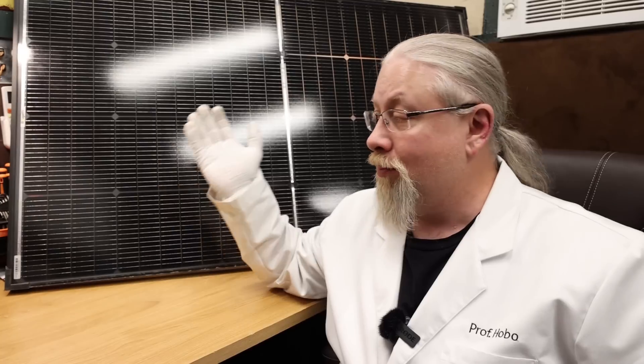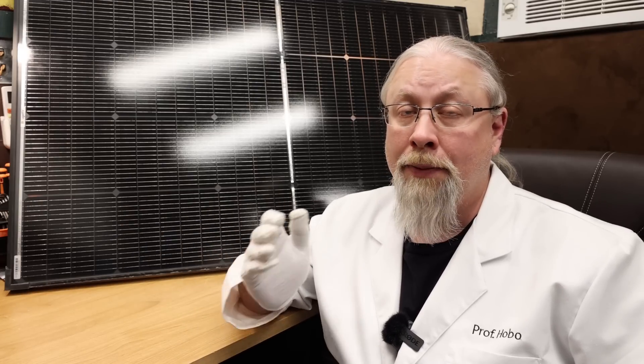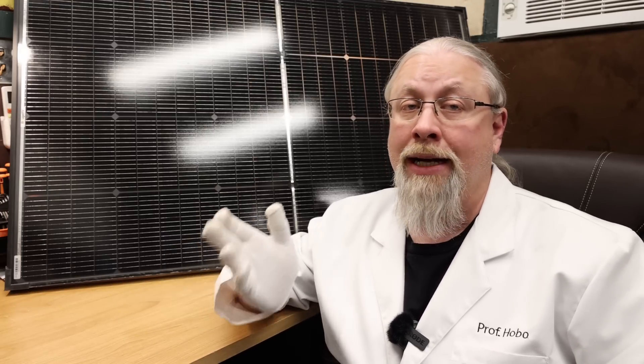There you have it — some really good results. On a typical clear sunny day, measured watts per square meter locally is usually around 1,200 to 1,300. During our testing, however, we measured between 1,020 and 1,080 due to high winds kicking up dust into the atmosphere — typical up here in the mountains in the springtime. At sea level under perfect sky conditions, you can expect 1,000 watts per square meter. Temperatures during testing were between 68 and 72 degrees Fahrenheit, which almost exactly matches lab testing conditions for solar panels, so these results should be fairly close to what most should expect in similar sunny conditions around room temperature at sea level.